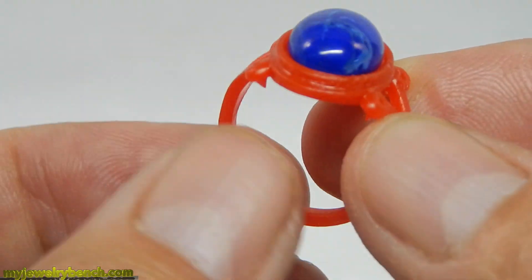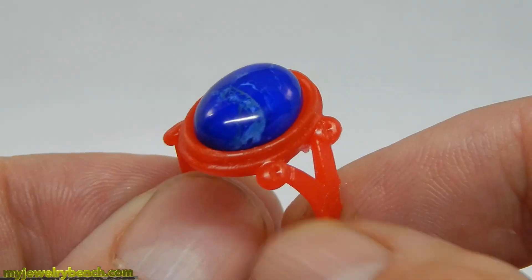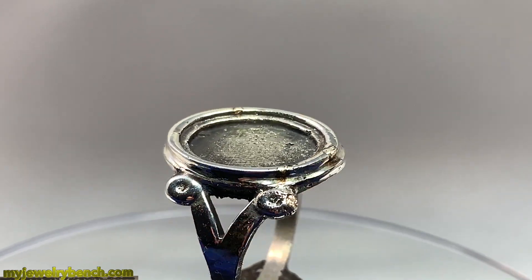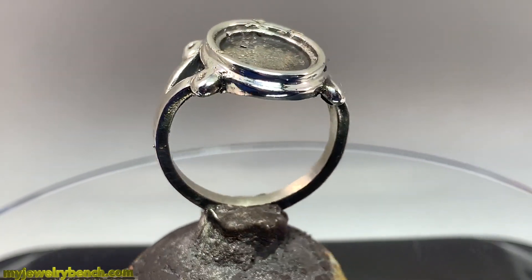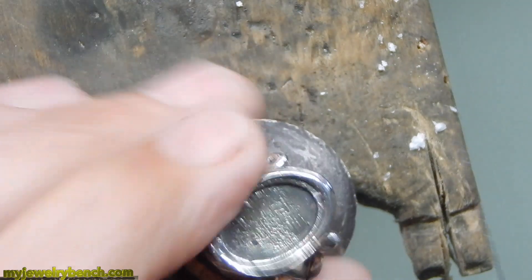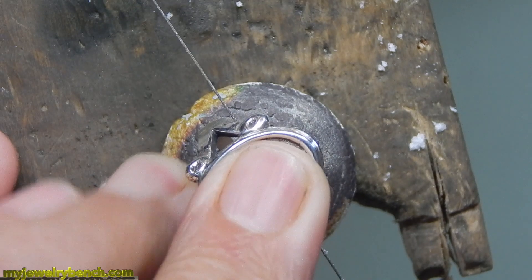The stone should fit a little bit loose on the sides, and it is a little loose because once casting is done I'm going to lose about two or three percent of the size, which should tighten it up and allow me to cut the bezel better for the stone setting. I sent it off, waited a few days, and it came back. What I got back was the silver piece with some blemishes — I used my laser welder to fill in spots that didn't cast correctly and smoothed out rough edges.